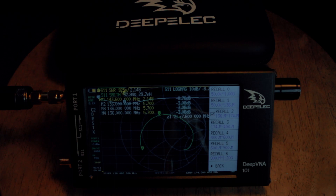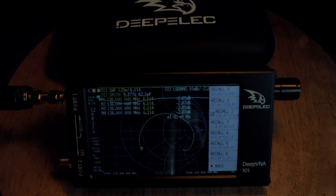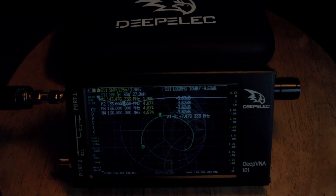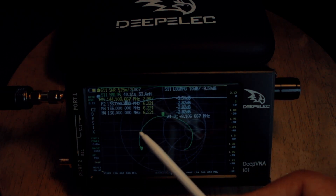The default dynamic range threshold of this precision tool is at 280 MHz, which makes it more stable and accurate for measurement. The harmonic appears every 300 MHz, but what I did was calibrate it to a more specific, narrower frequency range — that's why I'm using 136 to 174 MHz VHF.